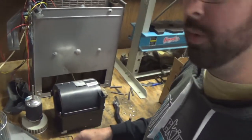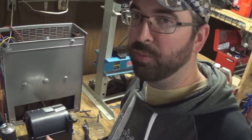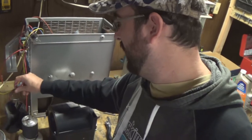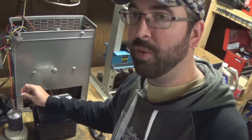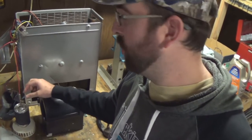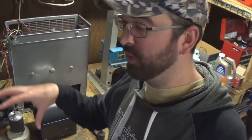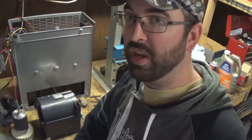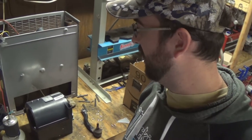When I took the old one apart, I kind of pulled the whole shroud, motor, everything out in one shot. Part of that's because I didn't know how it comes apart — I don't usually work on these. The other part was because this ground ran around the bottom kind of backwards around the shroud, whereas I would route it differently. Because it was routed around the shroud backwards, I really couldn't pull just the top part of the shroud off to get the motor out. So going back together, I'll put the bottom sides of the induction shroud and blower shroud in, then put the motor and fan on top with the top parts of the shrouds over all of that. Anyhow, let's get this thing back together and see how it works.